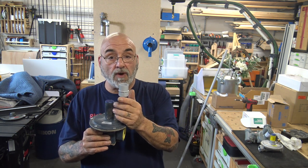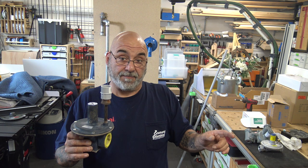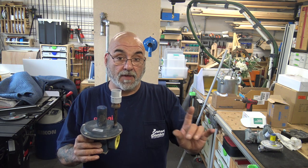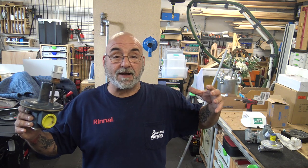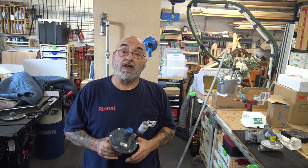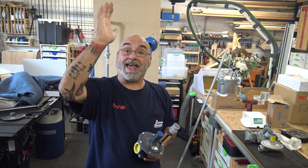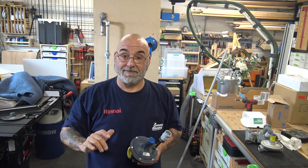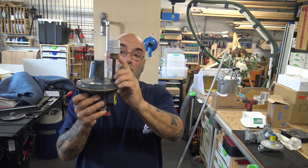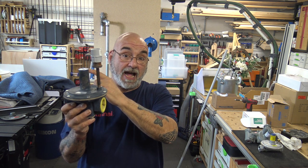Some larger equipment have what they call gas trains, where there is another regulator. It'll be like a third stage. There'll be another vent on it. You cannot tie these vents in together unless you make a massive pipe. So in New York, when we did these big, huge commercial boilers, minimum was 4 vents. Some of them had 6, 7, 8 vents. We had to run 8 lines outside the building from the boiler room. And that's the way it always looked. 1/8 inch nipple with a 1/8 by 3/4 bushing. This is as old as what I still had in stock in my shop here in Florida.